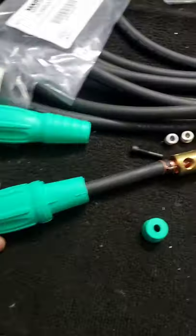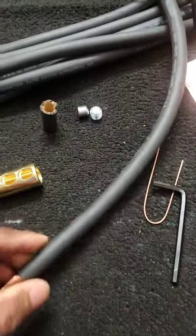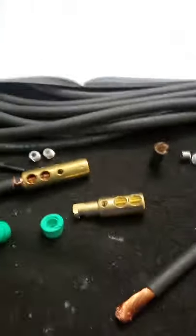First of all, this is what's called 2-0 cable — 2/0 cable. I'll show you how you write that. It's basically 2-0, that's 2-ought. If you want to go up to the larger size, it's 4-0. I know that typically with American Wire Gauge the larger the number the smaller it is, but when you get into the aughts, the larger the number the larger it is — the inverse is true. Just a little nugget of information to keep in mind.